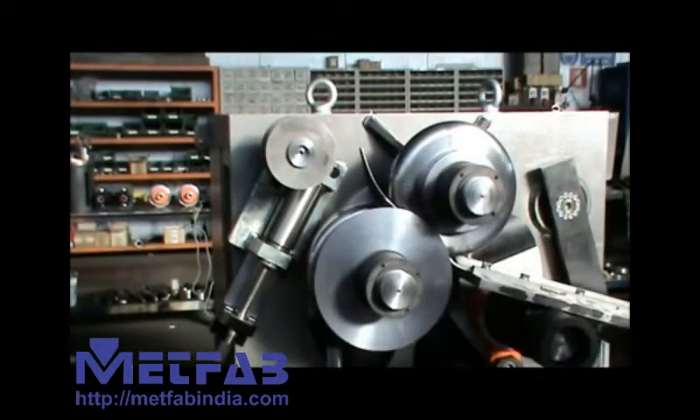Now we see how the profile is formed and bent together. As you can see, the guide is not exactly aligned with the forming rolls — that is in order to obtain an already slightly curved profile, to make it easy for the lateral guide roll to achieve the final radius required.